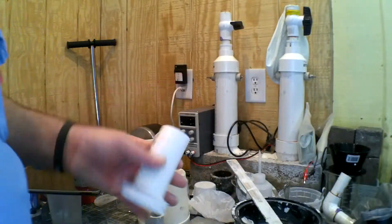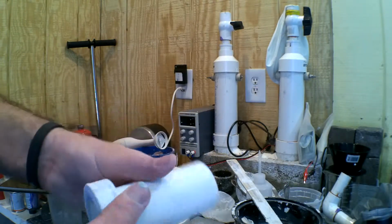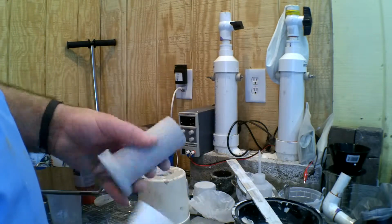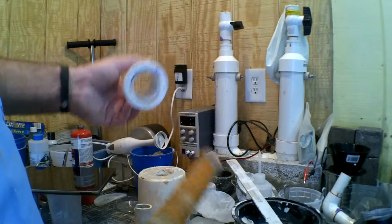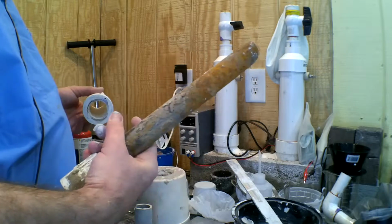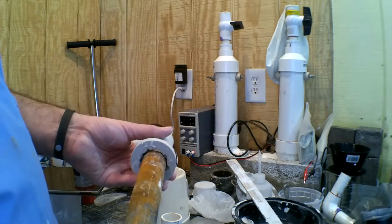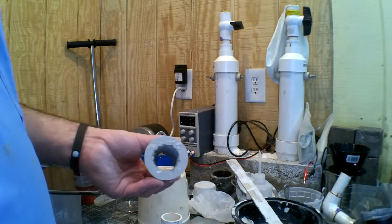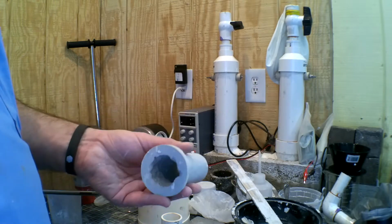sleeves. This is my first mold for something that's practically useful that I wanted to make out of porcelain, and here is an early prototype. It's not quite right, so this one will never make it into production, but it's a start. You can see this thing easily takes a tuyere, and I could probably modify this tuyere or make it slightly smaller if I needed to in order to maintain enough wall width. This thing almost takes it. I can get there. Not with this one, of course. I'm kind of in a race between accepting my tuyere and wall width. We'll see what I come up with.